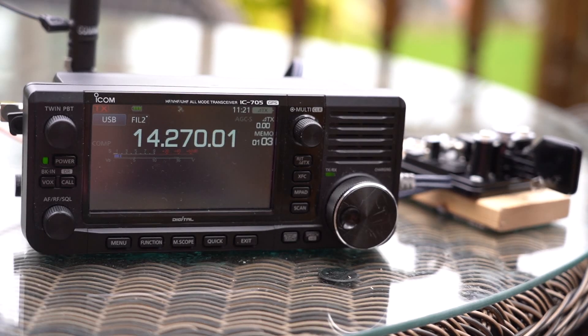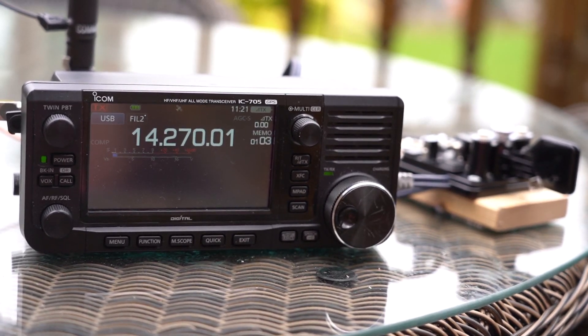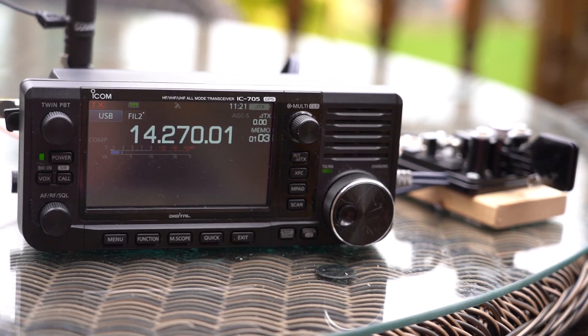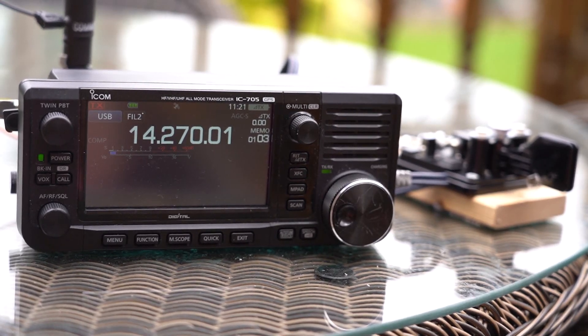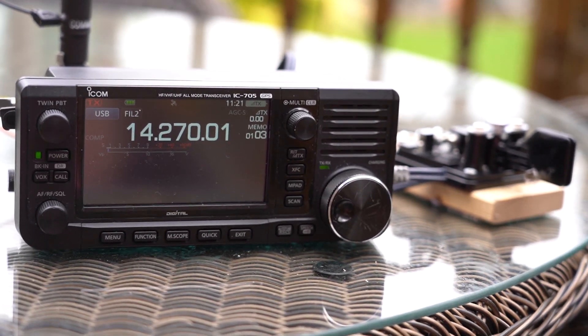When using the antenna in this way it's essential you add some radials. I added 4 or 5 radials and you will have to adjust those radials to make sure you get them the right length, because the radials are part of the antenna system — so you do need an antenna analyzer really just to make sure you know where you are in the band.